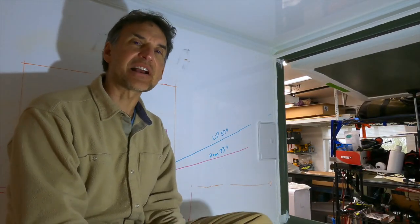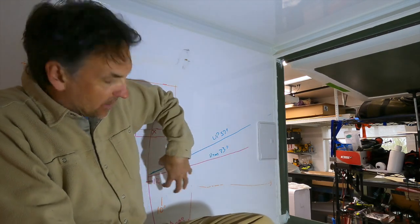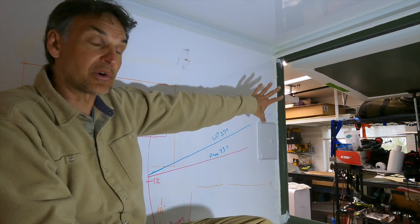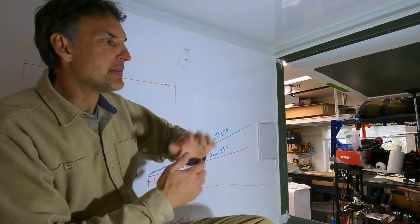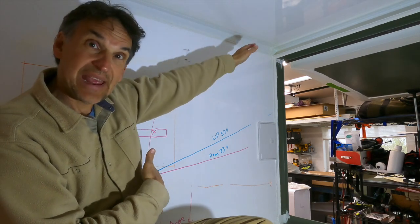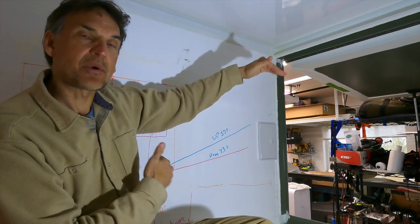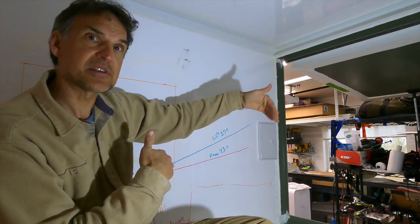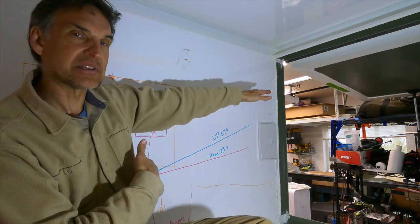Now I have to do some calculations that are a little bit challenging. I have to figure out where to mount my linear actuator on both the door and my wall. The actuator does two things: it extends out and also angles up as it extends. I not only have to get the length right in both situations and have some adjustability so the door is completely sealed when closed, but also the right angle when it's in the up position.